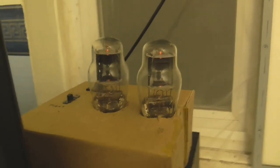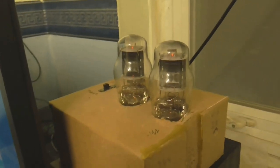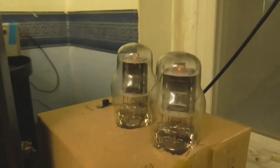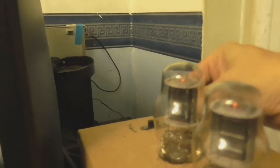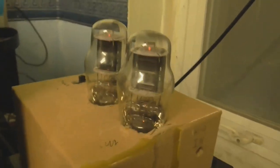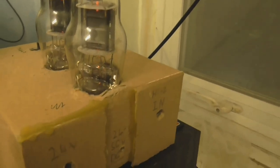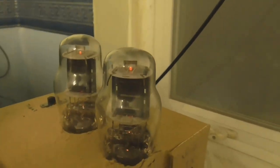so that's why that's it. The other reason why this is here is because I can connect anything that has a very high impedance output, such as my tube guitar preamp here. I can connect that up to that, and then connect this up to the computer, because this can take anything with a really high impedance input and spit out a relatively low impedance output. So yeah, it's useful when I'm using that as well.